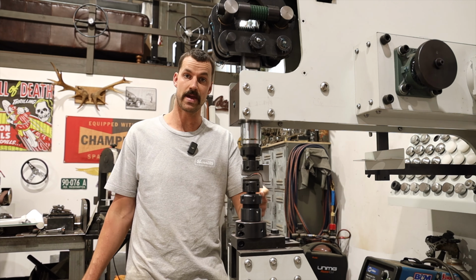Okay, multiple tries. I want to make this out of one piece. It's my goal. I'm still figuring out how to join all this. As you can see, I did hammer the bead back out. We've cut our flange. It's still there, but that's okay, because once everything's folded and done, I can hammer and dolly it and make it look pretty.